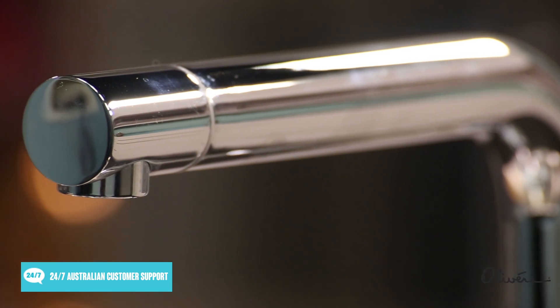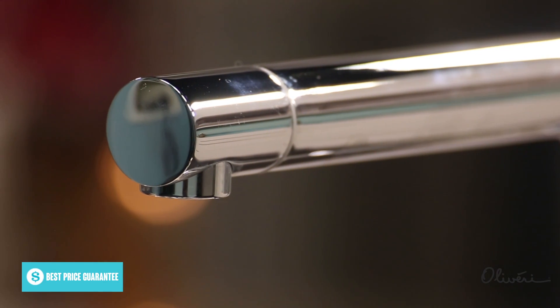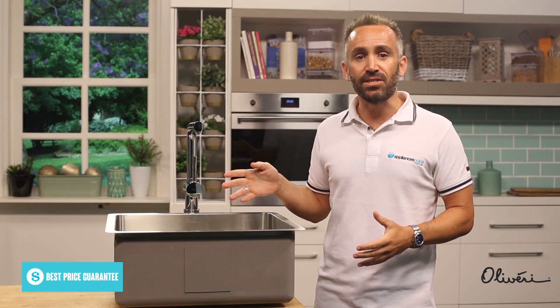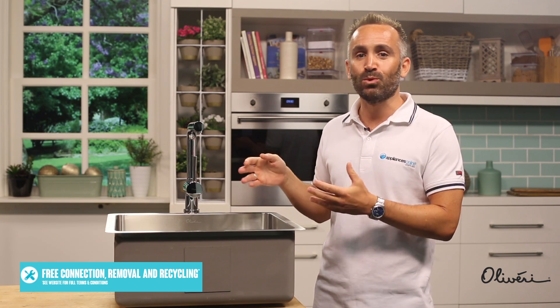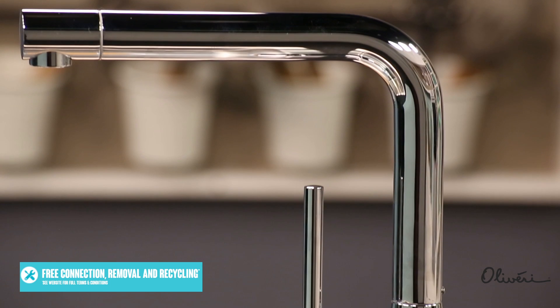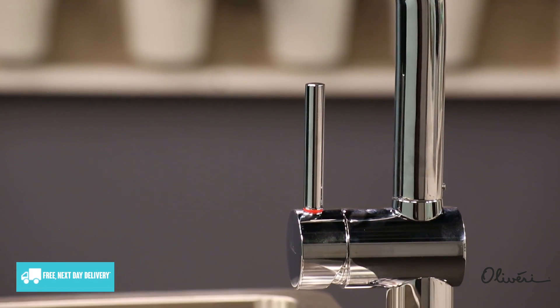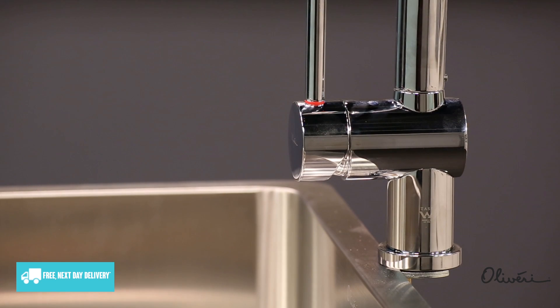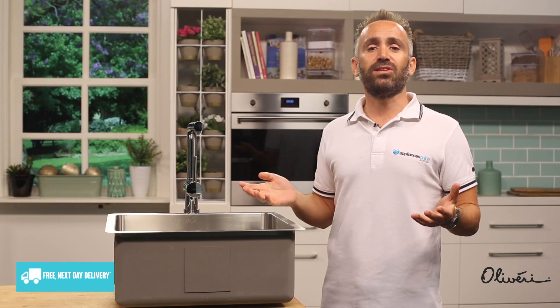There are a few more features to keep an eye out for when selecting a mixer tap. Mixer taps that include ceramic discs suffer less dripping and enjoy a smoother handle movement. A filter system may also be desired to improve your kitchen water quality for both drinking and cooking. It's also important to confirm that your tap of choice is compatible with your home's water pressure, and that the mixer you've selected has the Watermark logo, confirming that it complies with the Plumbing Code of Australia and the relevant Australian standards.